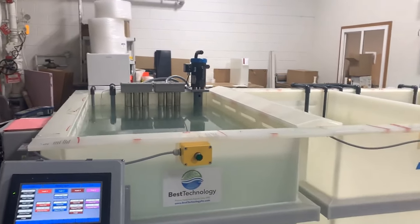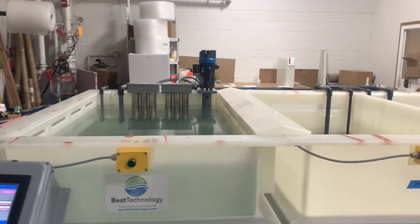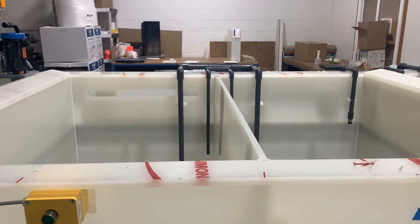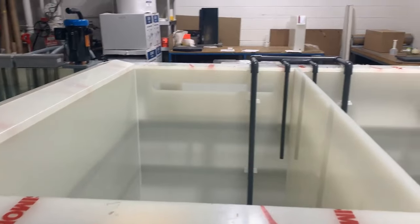The chemical cleaning tank features heat, circulation, water inlet, as well as water suction and disposal. The second set of tanks is a reverse cascade overflow, flowing from tank 3 to tank 2, to reduce any drag-out from one step to the next.